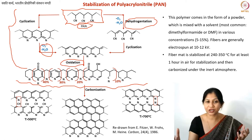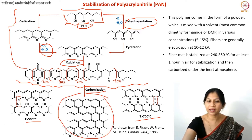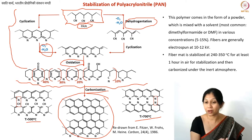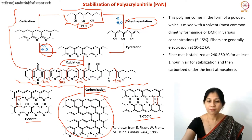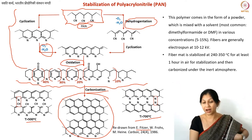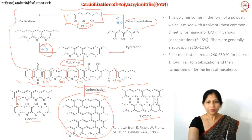Oxygen is needed up through the early stages of stabilization. Once these cyclic structures and further polymerized structures form, you then perform carbonization under an inert atmosphere. At around 500°C and 700°C you see specific chemical reactions, and finally you get large carbon structures that may still contain nitrogen atoms even up to 900°C. This mechanism was proposed by Fitzer in a still extensively cited paper.